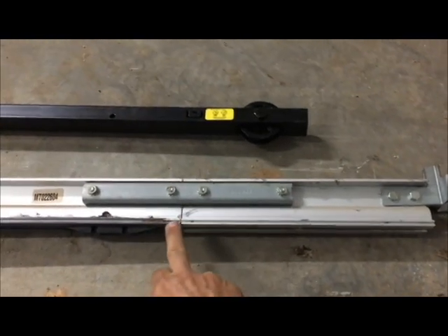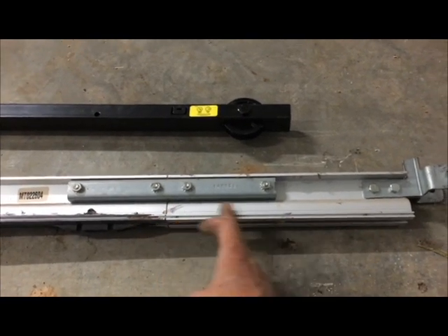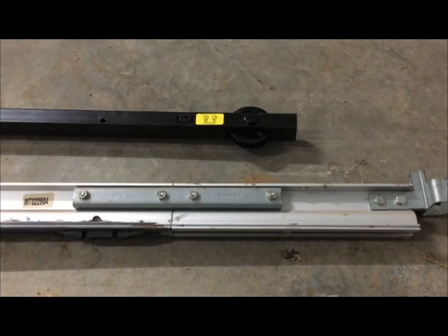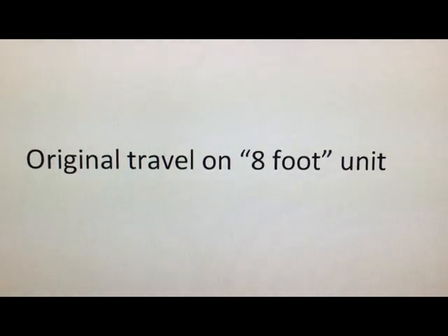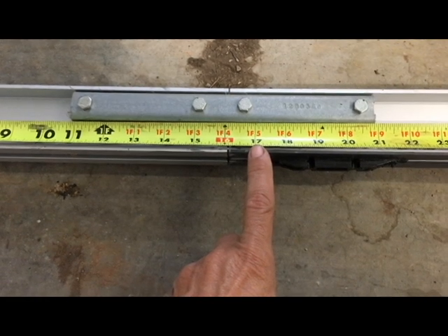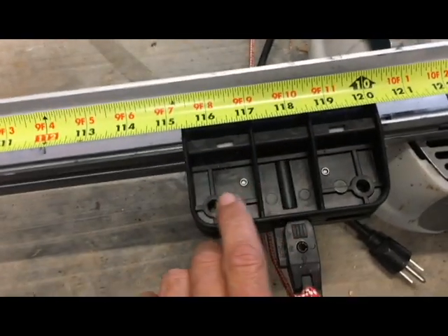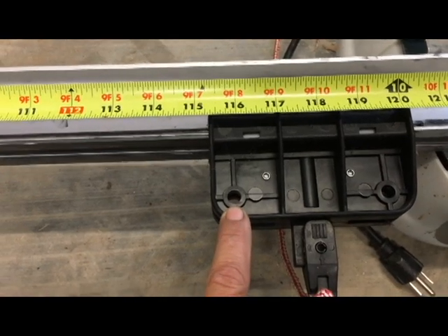The original screw drive's screw stops right at the seven-foot section — it was not even intended to go into the extension area. That gives me a clue about my options. It comes down to the amount of travel. The hole on the traveler started at 17 inches away from the drywall, irrespective of any mounting on the wall. It traveled down the rail, and for full open it ended up at 116 inches. That's 99 inches of travel required to fully open a 96-inch, eight-foot door.